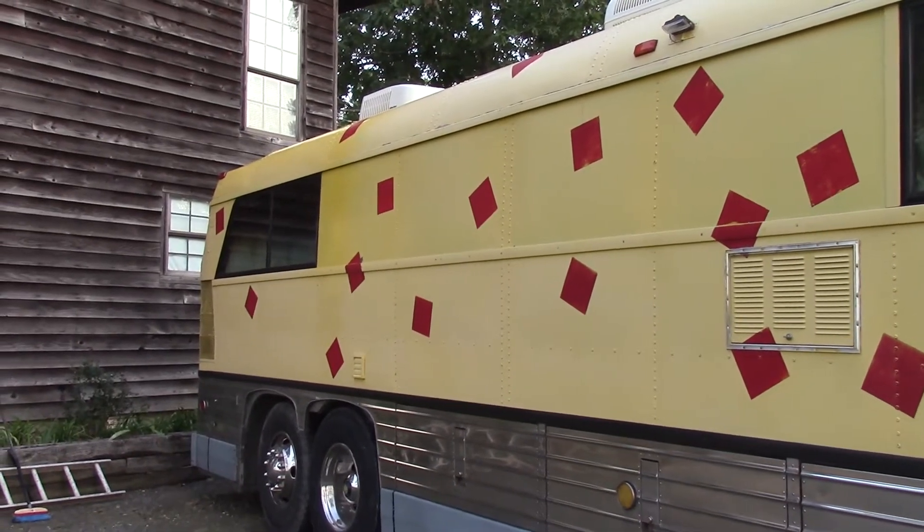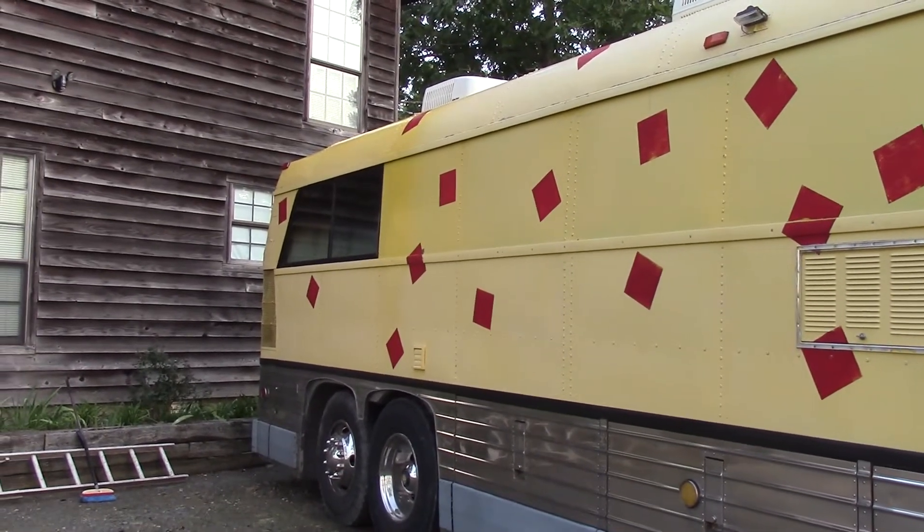What I would do next time is after painting, come back with a razor blade and slit the paint so it wouldn't be pulling against itself. Other than that, this would just take a light sanding and it'd be ready to spray another coat of paint on.